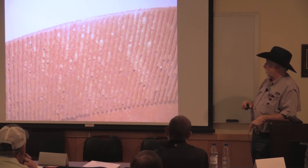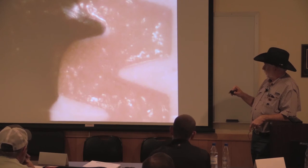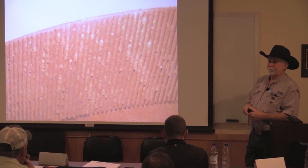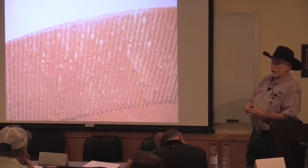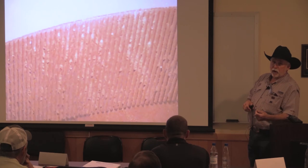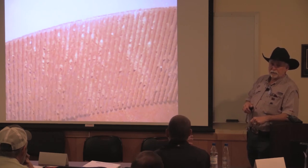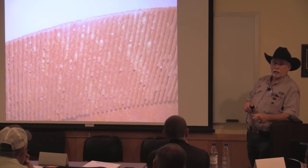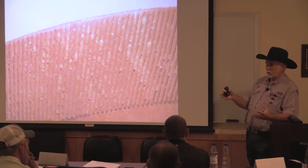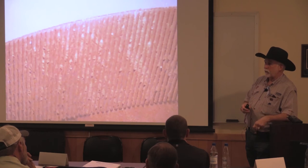We have some stuff that we're actually testing right now. It's an oxidizer, but the only way I can really describe it is it's a flash oxidizer. It oxidizes almost on contact. It makes very, very small particles. And we've been trying it, and they make a filter that actually will pull it out. There's a new product, but the old product was potassium permanganate. It actually attaches itself and grabs that stuff out of solution.